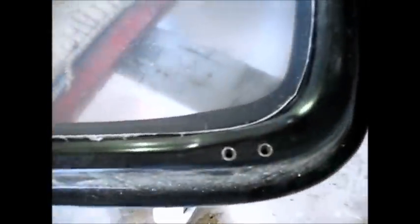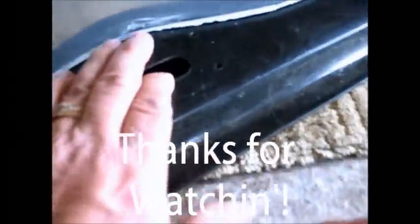I got this cut out. I cut it out with a grinding wheel rather than a saw blade, because what was happening — the saw blade would heat this up and it would flow back in behind the blade and kind of weld itself back together as I went. It did something similar with a cutting blade, but the cutting blade exerted enough force to make it more sustaining. I put a different wheel on my grinder and I'm going to go around and knock these rough edges off. I'm going to adjust the way the corners fit — there's a little bit of a high spot right here, and this bottom needs to come up about an eighth or a quarter of an inch, so I'll work all that with the grinder.